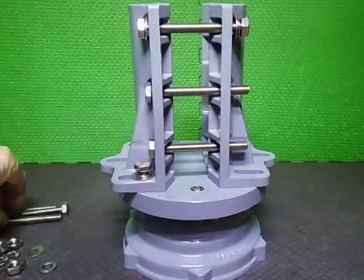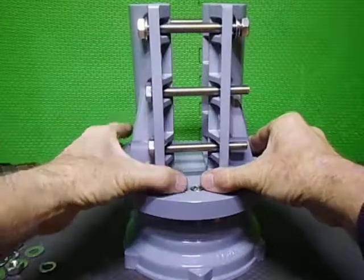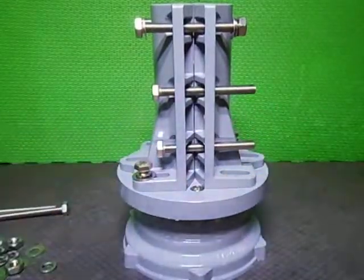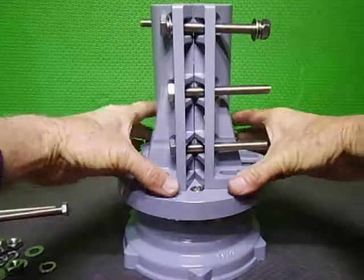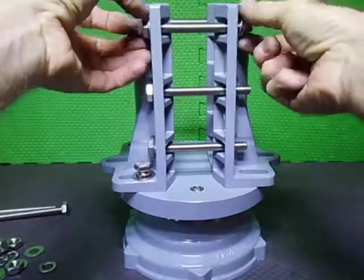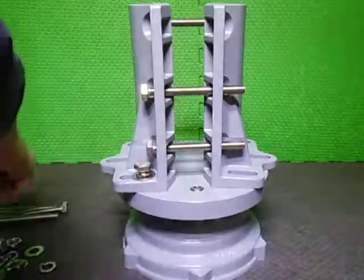So 6 bolts in there all up, and you can actually turn these around the opposite way, and put them in from the opposite side if you wanted to. But yeah, 50mm to 80mm, so that's all the way out, and that's all the way in, and that will clamp 50mm. So I've developed that for the 1280 that I'm doing, and it can be used on 1200s, 1105s, 1300s. This adapter plate.